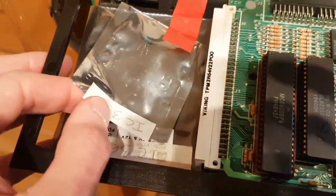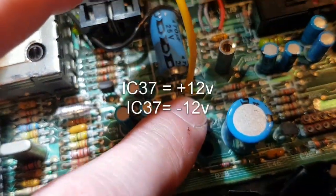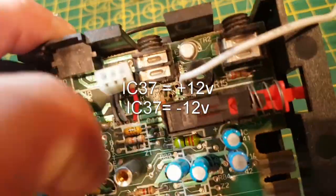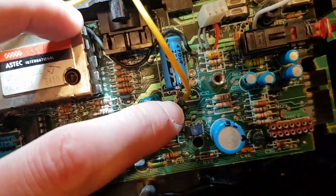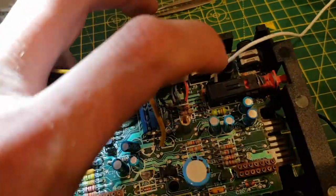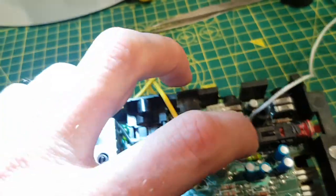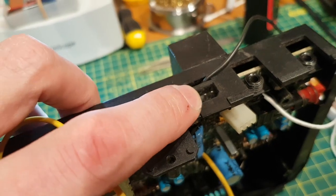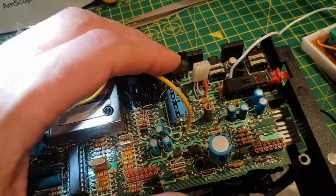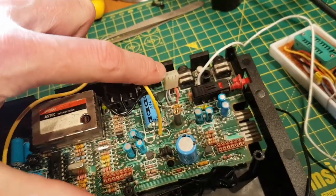There was no power supply so I had to do that first - I've shown a video on how to do that. Basically you desolder IC37 and IC36, which are both essentially transistors. You inject plus 12 volts and minus 12 volts into those points, pick up ground from the middle of the power connector, and get your 5 volts - remembering that the 7805 is oriented so that this one is the output, not the red wire.